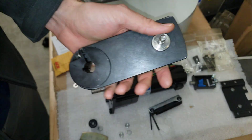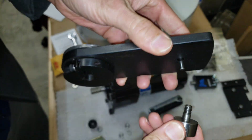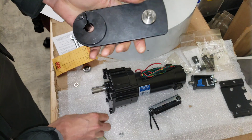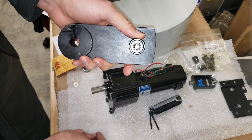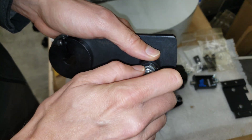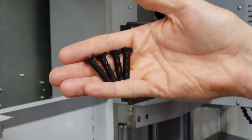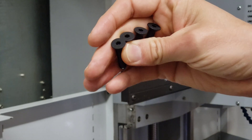To put it back together: the tooth washer goes on first, then the nut — tighten that down. Put the ball bearing on, and for right now I'm just going to put the nut on here because we have to pass it through the slot first before we can put the plate on. I'll put that on there loosely and the plate will go in there later. The screws we'll be using to attach the umbrella shuttle motor are one-quarter 28 by one-and-one-quarter socket flathead screws.